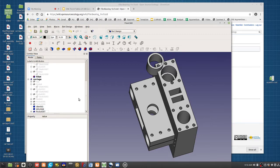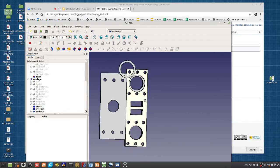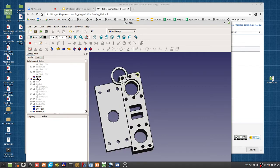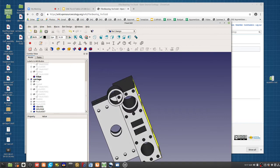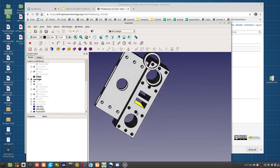The standard technique that we used before is the universal idler carriage closure. So this could look a little different here. We can use these bolts here for carriage closure. So say we just did this here. We already have these bolts here that Ken did. And this is all for M6 bolts. They're printed as about 5.5 millimeters, so you actually thread into them. So the concept here is everything threads in.